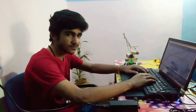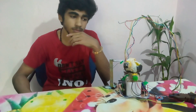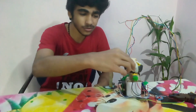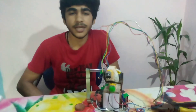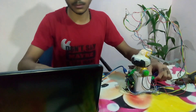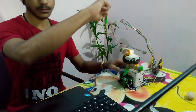It's time to program. But nothing worked as I thought — everything went wrong. Even my idea of routing wires through the top was also flawed. The solution I found: if I rotate this motor in one direction and on the next turn rotate it in the opposite direction, the wires won't get tangled. I also had to change from a single battery to a 9V adapter. Another problem was the speed of the bottom motor was too high, so I decreased it using PWM.